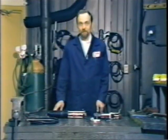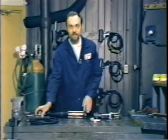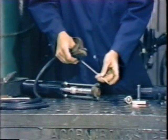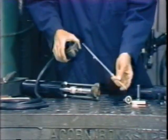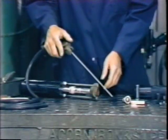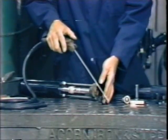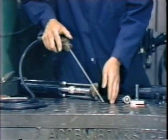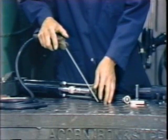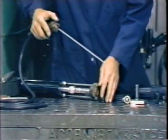The principles of stud welding are adapted from arc welding. In manual arc welding, a flux coated rod is used — a steel core — and it's held in an electrode holder. The sequence of operations is the operator will touch the base material to initiate an arc, lift away from the base material, and then proceed with travel and a desired length of arcing. Then at the end he breaks the arc by lifting away from the base material.